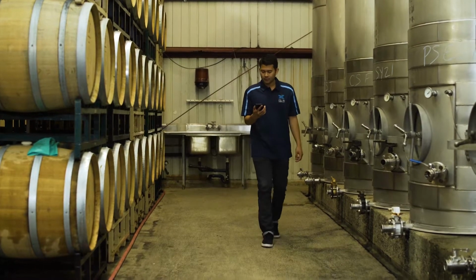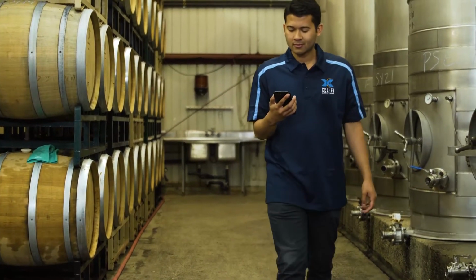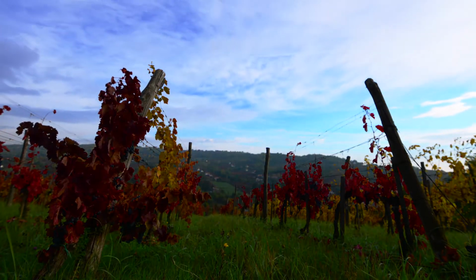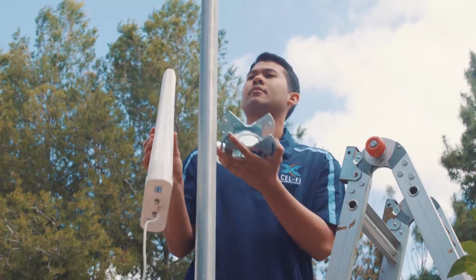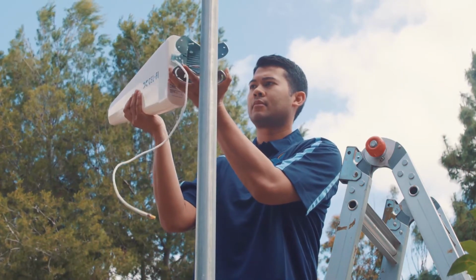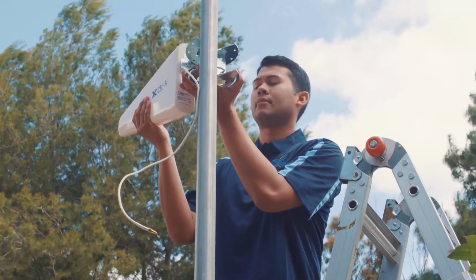Use your cell phone to find the area with the best signal strength. This area may be indoors or outdoors. This is where you will mount the donor antenna. For best performance, try to keep the distance between the donor antenna and the GO unit as short as possible. Now find a specific location in the area that had the best coverage for the installation of the donor antenna and mounting bracket. Don't mount the antenna or bracket yet.